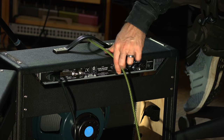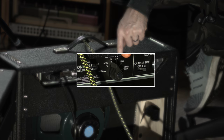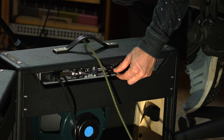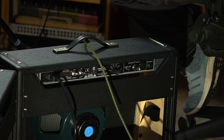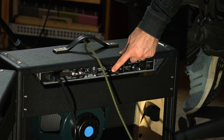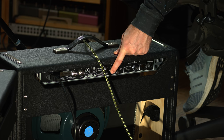It has an attenuator, a power soak, which actually is kind of bullshit, because what this is, it's a volume. It's literally a master volume, because this is a Class D amp. It does need to be attenuated. But I love that Fender actually disguised it in a clicky switch, like an attenuator would be, so that we are kind of fooled into thinking this is a tube attenuator when it isn't. What you cannot do is get it actually completely silent. This is something 0.1 watt or whatever. So it's very, very quiet, but you cannot completely turn it off.